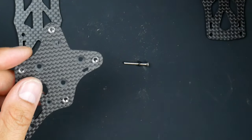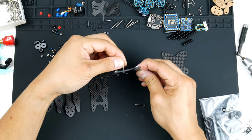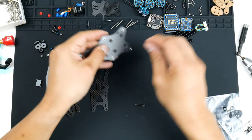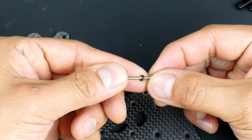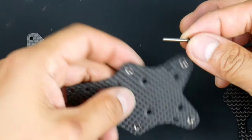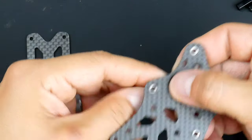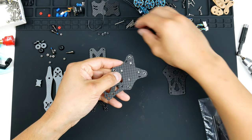Now, when you put an M2 stack screw into this hole here, it gets a little bit loose, as you can see here. It doesn't really make me feel comfortable having this sitting in there. So what the frame comes with are these little O-rings. I don't know if you can see that there. It's a tiny little O-ring. What we can do is fit them on. I don't know if this is actually the intended purpose for these O-rings, but I'm going to use them anyway because I find that it actually does sit in there quite well. So we put that in. I've got these other three prepared already with the O-rings. Put them in